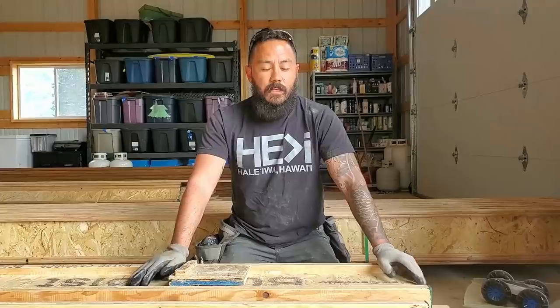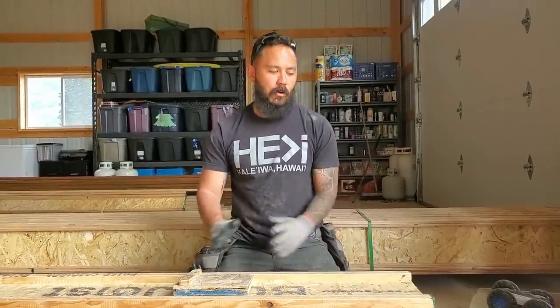The reason we're stopping at 8 for the time being is that we have a hatch that's going in the floor so that Melissa and I can access the crawl space when need be. All right, these BCI floor joists are full length. They're going to run the full span, the full width of our home site and the home foundation. On either end, they're going to be supported by the actual foundation walls. In the middle, they will be supported by the pony walls that we've already got set in place.